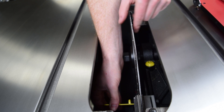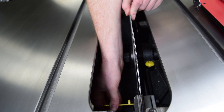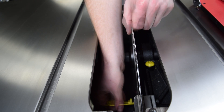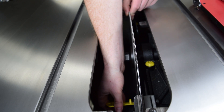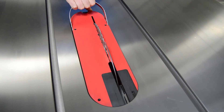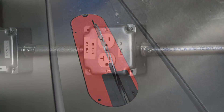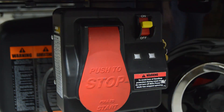Verify the distance at the top of the brake, then move the gauge or nickel to the bottom point of the brake, making sure it's positioned flat against the brake pawl. Rotate the blade a full revolution by hand to verify that the blade and brake do not touch. Once you've adjusted the brake spacing accordingly, replace the table insert. Restore power to the saw and turn it on. The saw should power up normally and the LEDs should display the system-ready solid green status code.